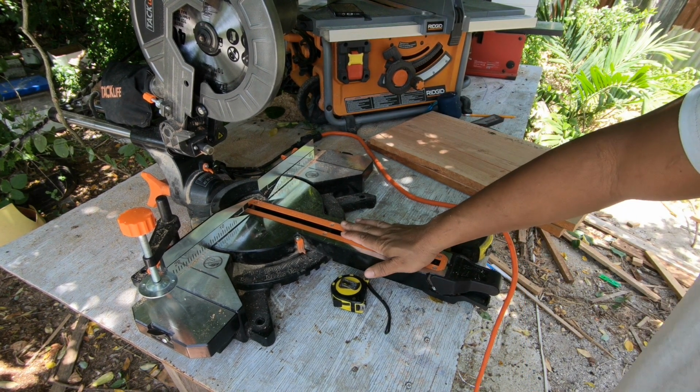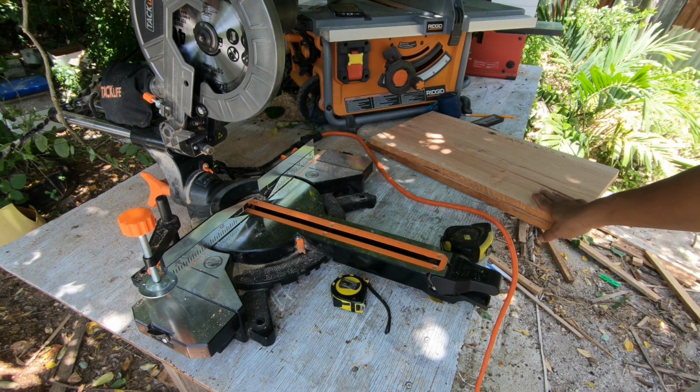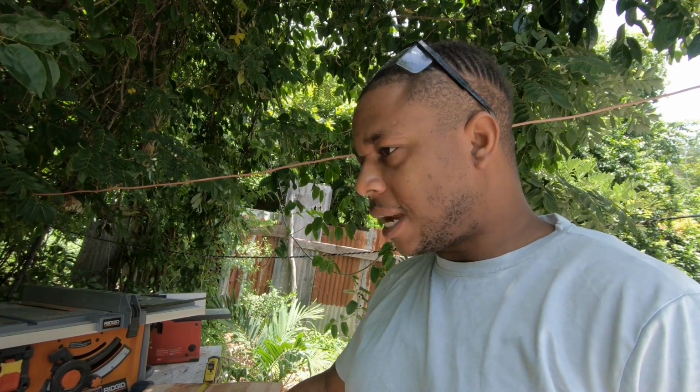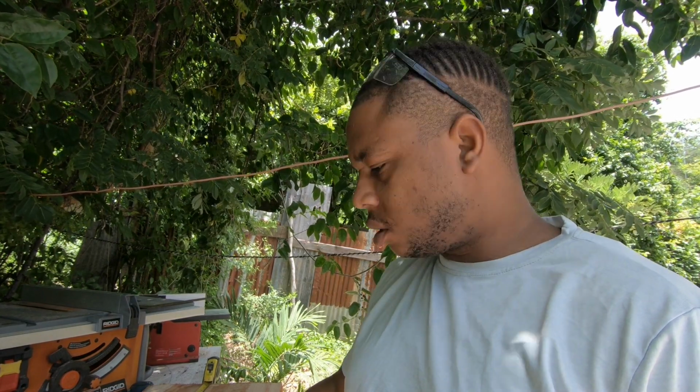So I'll be going through a bunch more to cut them up. You don't really have to see that part. The most important part, you just want to see that I'm cutting them in manageable pieces to be jointed. For us to do the cutting for the side part, mine are normally 16.5 inches. So again, because we're gonna be taking into account the overcuts, I'm gonna do each section by 18 inches, and then that'll allow me 2 inches in between where I'm making a final cut to get both sections squared off. So same thing, same process.